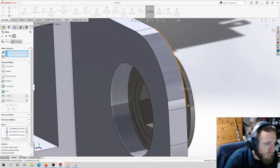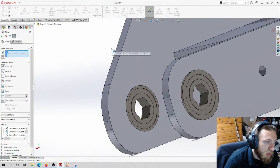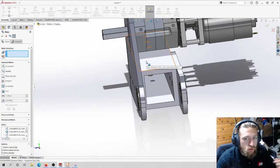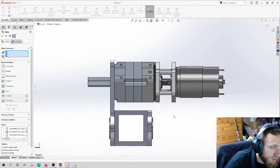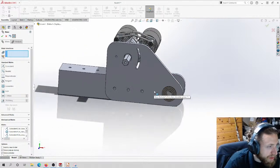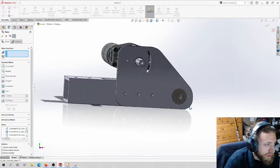And to stop it from coming off in the other direction on the shaft, we're going to use spacers, acetal spacers, so plastic spacers, and we're going to drill and tap the shaft. So you tighten a bolt into the shaft, and that's going to compress everything onto the shaft and stop the bearing from coming off. So we will probably make those spacers in a minute.